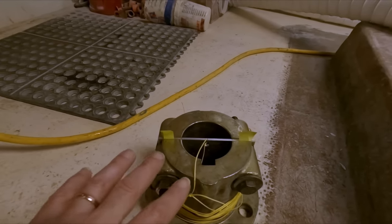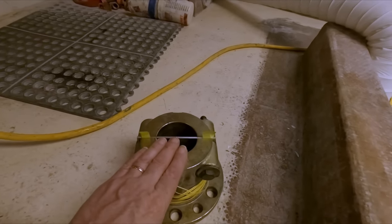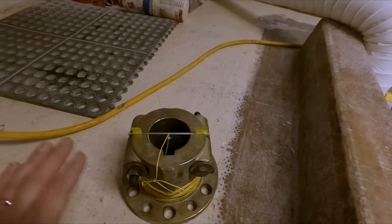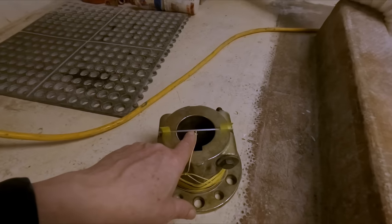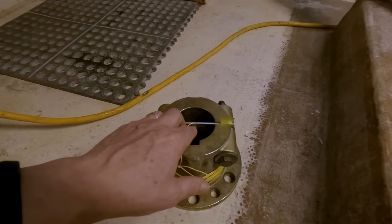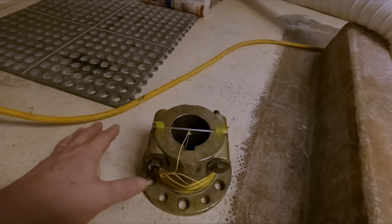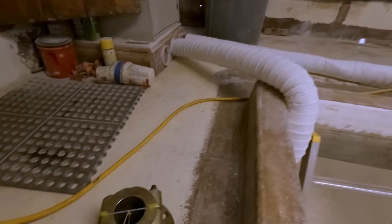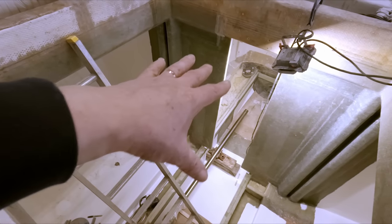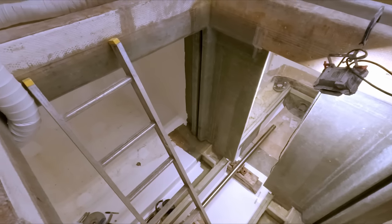So really, for this type of thing, since we're just using this as a start point and an end point between the two to align everything in the middle, the positioning is still critical, but a few thousandths won't make a difference one way or another. A quarter inch, an eighth of an inch, yeah, that's a different story. But a thou, that's not gonna matter any. And the reality of it is that if this whole shaft anywhere on it is within 3/1000ths of being perfectly true and straight, then we're in very good shape.